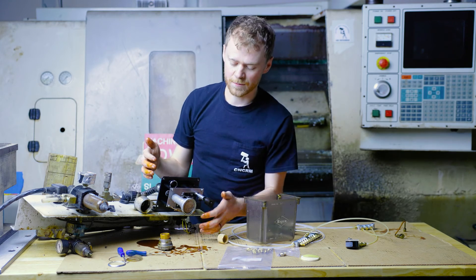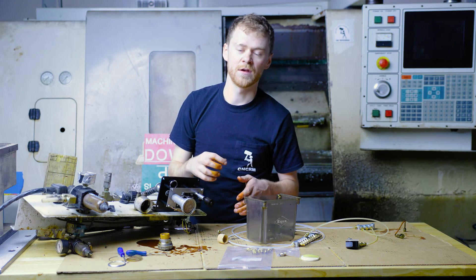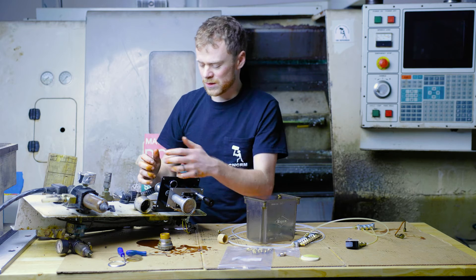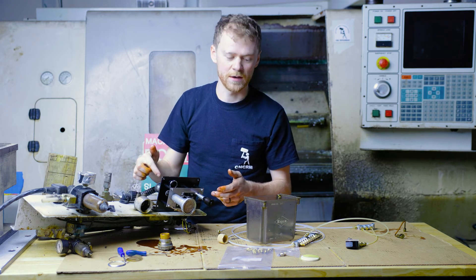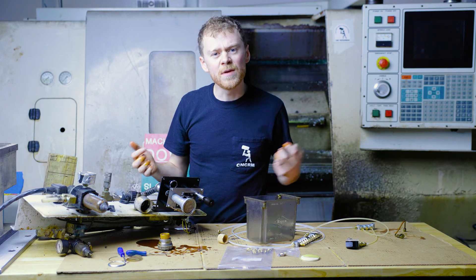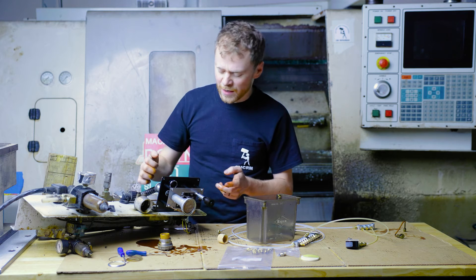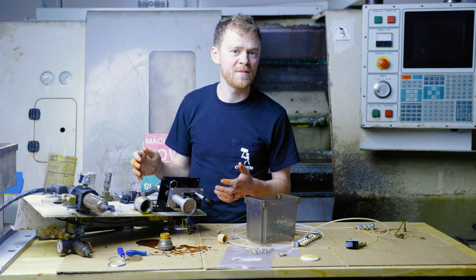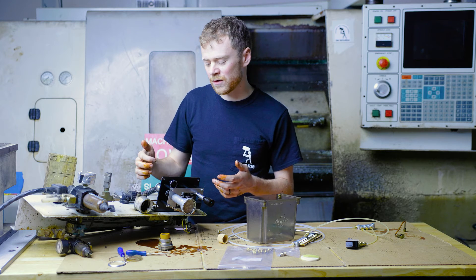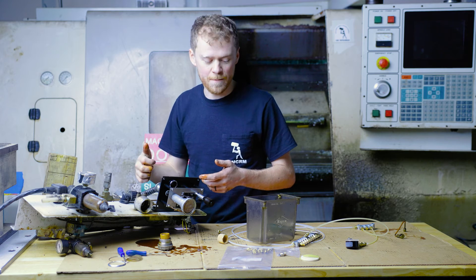After you've done this on your system — you've pulled this out, you've pulled this out — your system has a lot of air in it, and you're going to want to bleed the system by just kind of pumping it. That'll bleed all the air out and pressurize it, because it'll pump it through the metering units. But if the little cam on the gear is in the wrong spot, you can't pull the plunger up. So you'll need to run your spindle for five or ten minutes until the gear moves and the plunger drops, and then you can grab it and pump it.